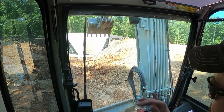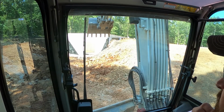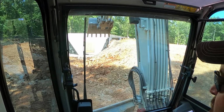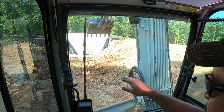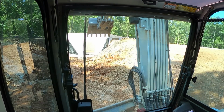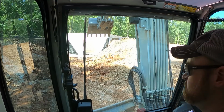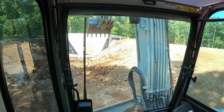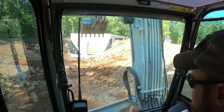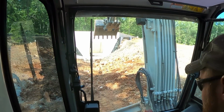And then after I do that, get it roughed in and leveled where I want, then we'll go back and dig in the perimeter drains, just because they're up there at the top of the footing, and that way I'll be done cutting and stuff. So that is my plan. We'll see how that actually works out. But I just need to rake it, loosen it, cut and shape and add here and there.